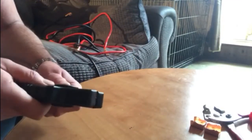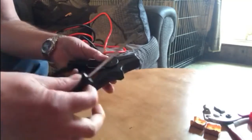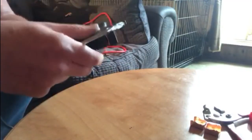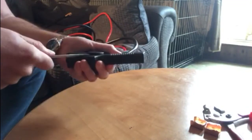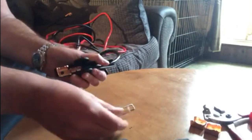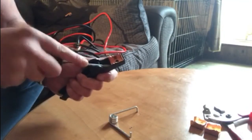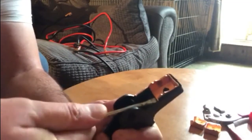The easiest way to do it: first, check which side the clamp is hinging on. On this particular one it's this side that does the hinging. Take a flat-headed screwdriver, slide it up underneath there, and just give it a twist. You'll feel that side of the handle move. Do the exact same thing on the other side — get the screwdriver working into it and twist. Take that out, slide it out, and take the spring out as well. Inside the clamp you'll see the copper cable and copper connection.